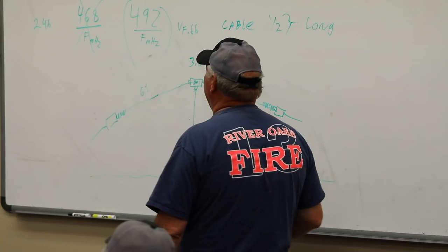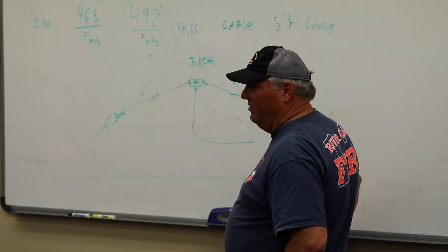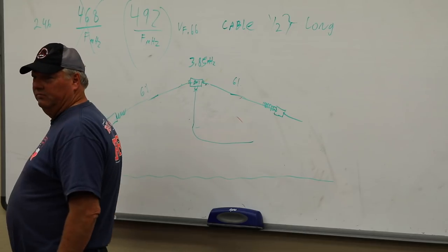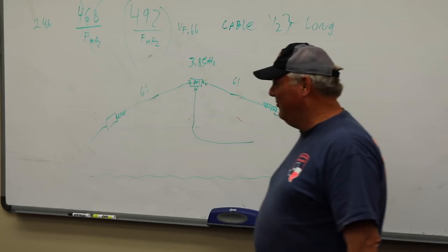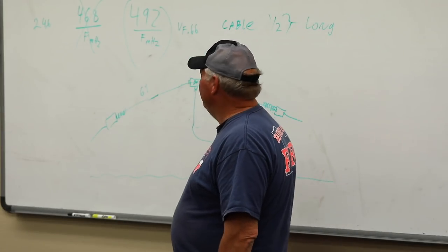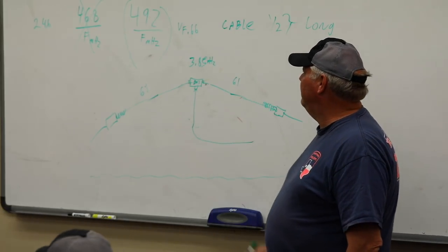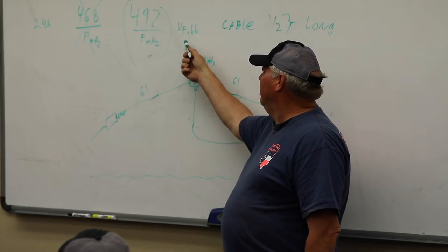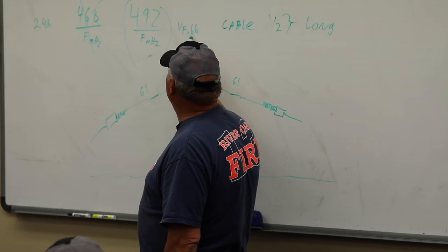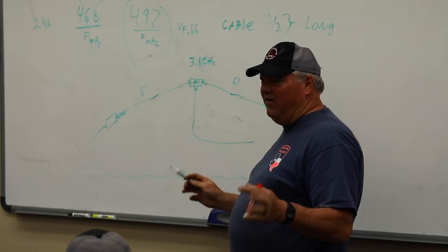So who's got the calculator? Let's do 492 divided by 3.85 and multiply it times 0.66. It's going to be an interesting number. 492 divided by 3.85 is 127.8, times 0.66. 84.34. So about 85 feet of cable.